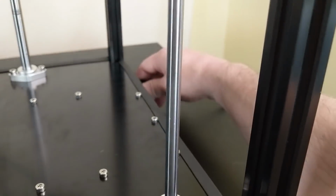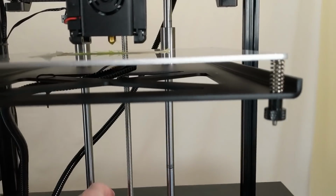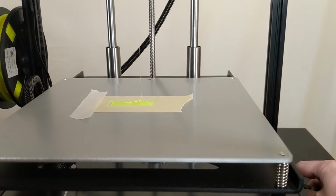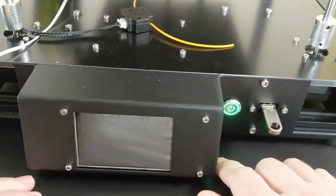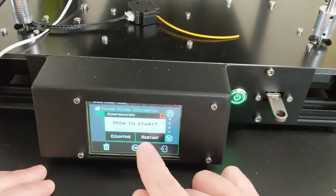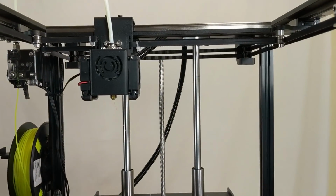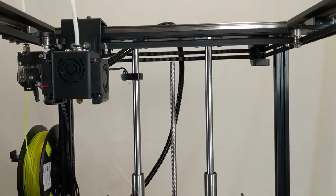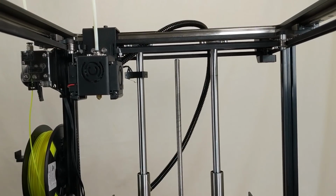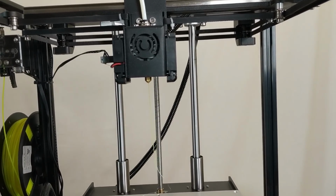And now I'm just gonna come over here and unplug the machine. Here's the problem though. This time it didn't move, but what can easily happen is that... see, I'm not even touching it now. The bed's just falling, and it's gonna fall all the way to the bottom just based on gravity. We'll just turn this back on, and we'll go here, print, we'll choose the print again. Okay, and it asks us if we want to continue from where we left off, and the answer is yes. But the problem with this is it's going to home in X and Y, but it will not home in Z, which means it's just gonna start printing in the air. So it technically has print resume on power loss, but it's not very effective. See what I mean? It's just printing in the air. The print's way down there.